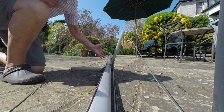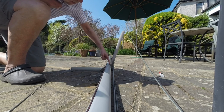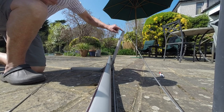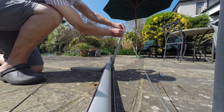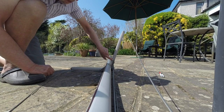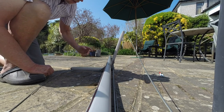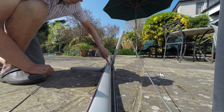I've got four holes on each mast - yours may well be different but the principles are the same. We've got the amount of angle we can put in by changing the bottom screw here; this is the pivot point. We've also got the length we can adjust here with a pin you can just pull out and move up and down. I'm going to concentrate on the angle and adjust the bottom, which will change the angle of the spreader.